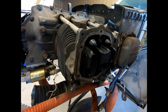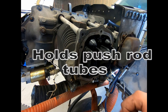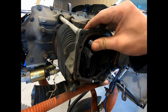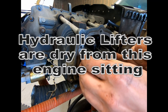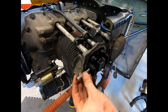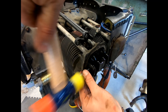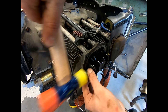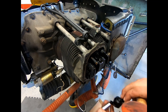Here are our rocker shafts and push rods — this is what holds everything in — and our valves here as well; we've got intake and exhaust. Those are pretty dry at the moment, and we should be able to push that rocker shaft out. We're going to have another go at getting these out before taking it off, because it is the way you're meant to do it, and I did spray it with some lube. Not too bad — okay, perfect.